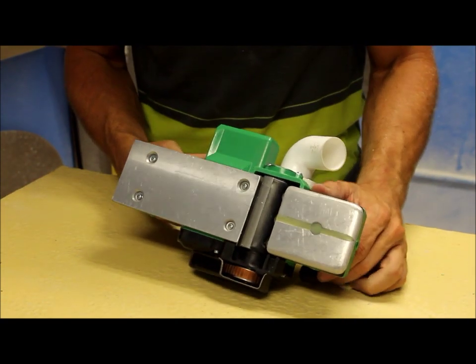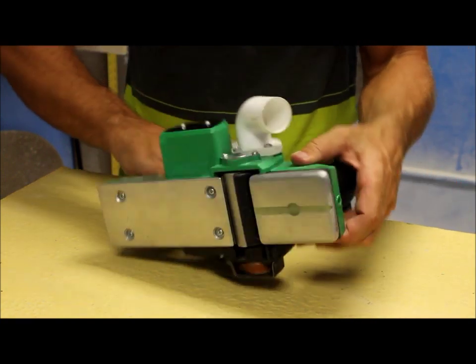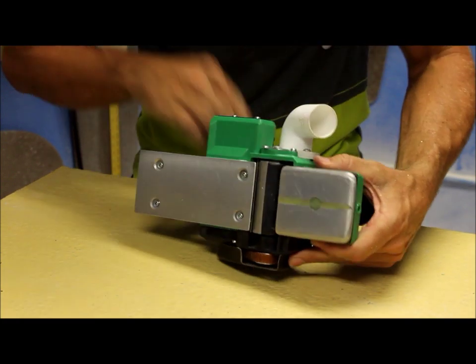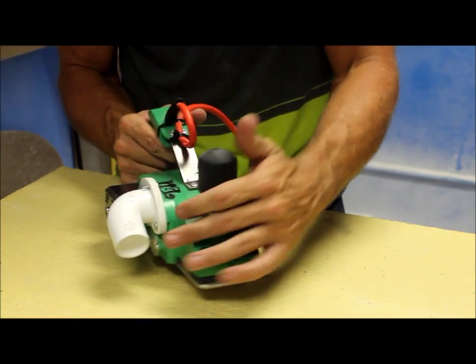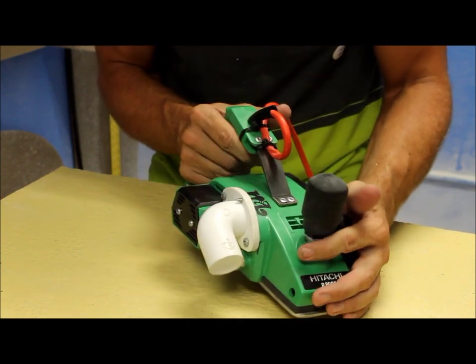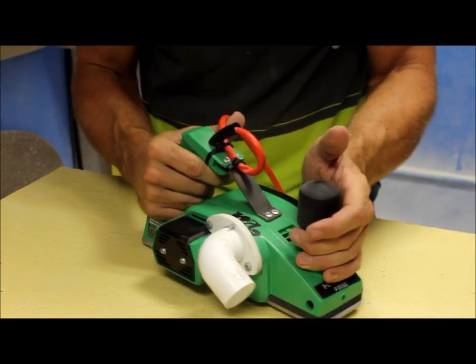Next, the shoe is also modified. You've got rounded corners on it, and this groove is usually filled in with a 5-minute epoxy. What that's for is when you're running over a piece of foam, it's not catching or leaving gouges or marks from a sharp edge, so it just works out a lot better.